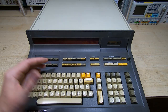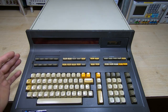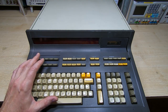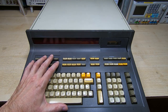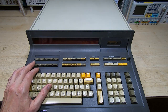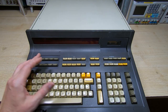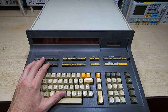The move towards desktop, smaller computers grew from there. This is a very interesting machine — I like working on these. Very discreet in their design. There are about a thousand ICs in this, and if you've watched the repair videos you'll see they're quite complex. There is no central microprocessor chip, but there is a microprocessor system — it's discrete in nature, a set of boards based mostly around 74-series ICs. It's very powerful and was released in the very early 1970s.